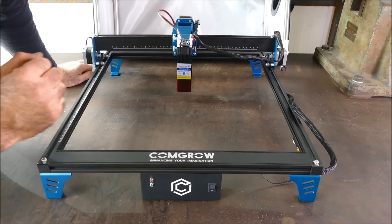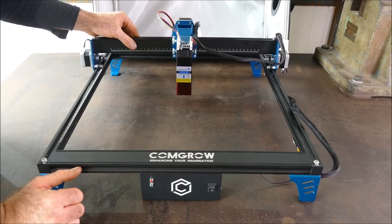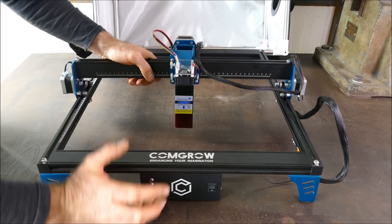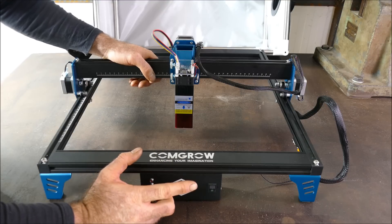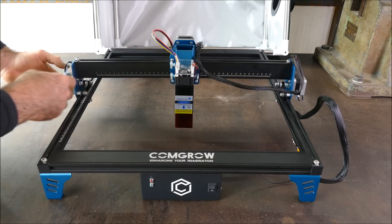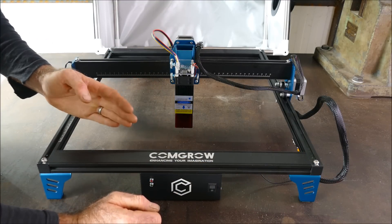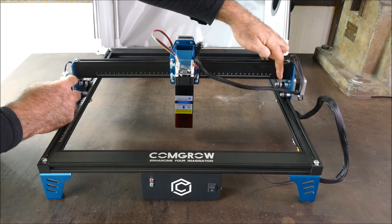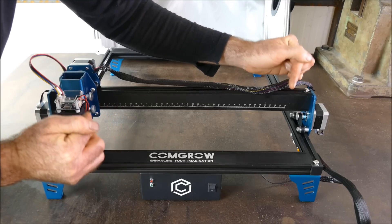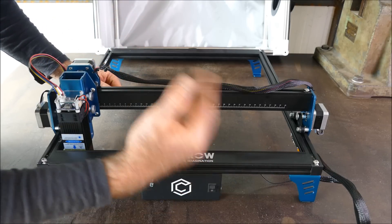What would I consider special about this laser other than it being extremely affordable? Well, for a 10-watt laser it is extremely affordable, and being all-metal construction it also has dual motors for either side. That increases the torque, not the speed, but one other benefit is it actually helps keep things aligned. With a lot of other lasers you've got a central bar that goes across, and if you've tensioned your belts slightly differently it will pull the laser slightly skewed. With independent motors, when it homes itself and triggers the limit switches, it's set to zero on both motors — so any belt tension differences are eliminated.